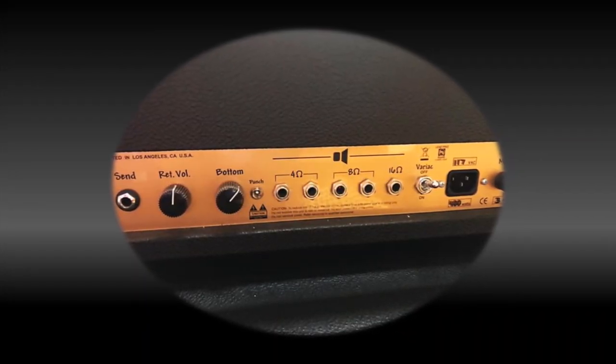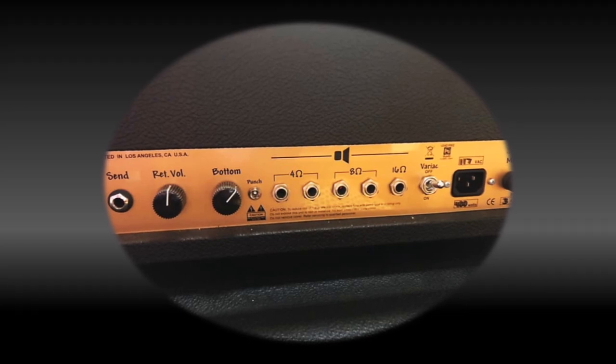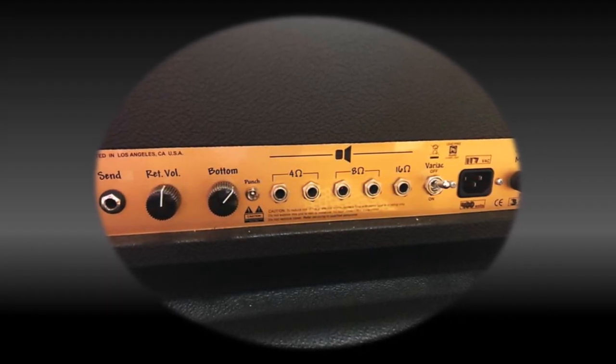While you could certainly run just about any guitar amp off of a Variac within its acceptable voltage ranges, some just have one built in for you, and you may not have even known it. So Bogner is relatively straightforward with their Variac implementations because it says Variac, so some of their heads have a switch. I believe a Helios does, I think the Ecstasy does, and from my understanding, they're just running off of a different tap on their main transformer, so it's technically a voltage regulator, just not necessarily having to use a different transformer to achieve that.